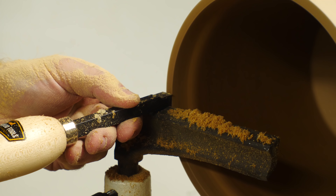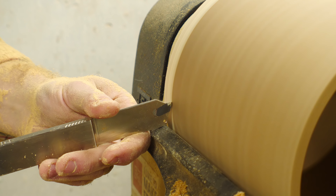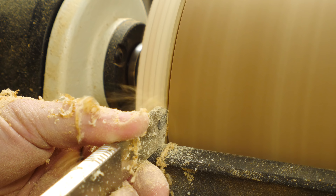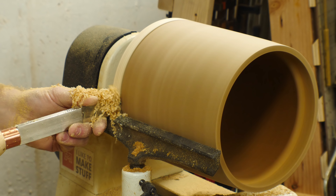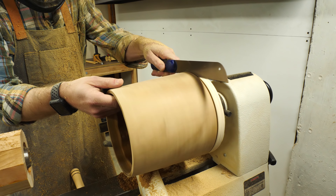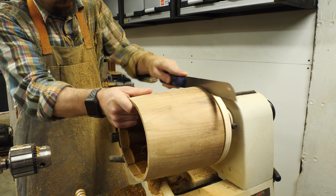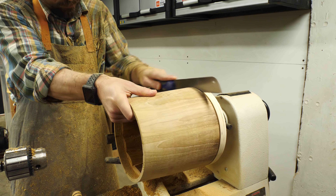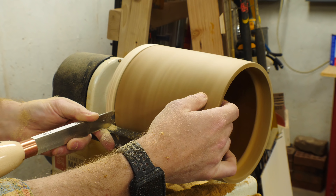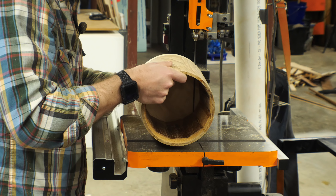The last little step was to flatten out the bottom face to make sure that it would sit on the table, and then I used a parting tool to start to separate it from the base that I glued it onto. I cut in a groove right where the two pieces of wood met, but then I started to worry that it was going to fly off again. I slowed down the lathe and ended up reversing the direction before using a pull saw to actually cut it loose, so I could hold it in place to make sure it wouldn't fly away. I went back and forth trying to figure it out, as I'd never done this part before. Eventually I just took it to the bandsaw and cut it away.